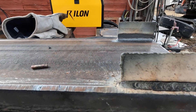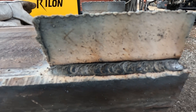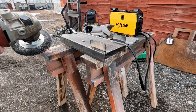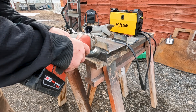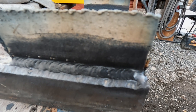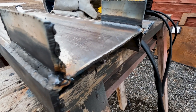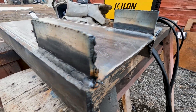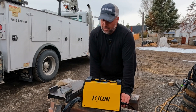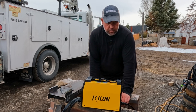Wow, that was turned all the way up — maximum amperage. You can see we actually got a pretty good weld in there. The fan kicked on about halfway through but it had no problem completing that four-inch weld. So that burned in pretty good — I think it looks better in person than it does on camera. It definitely got full penetration. That's just slag. As you can see, that's eighth-inch steel here on a little I-beam — that's where I cut the coupons out. I had it turned all the way up welding hot and it did pretty good. I'm surprised it didn't cut off on itself, being only a 30% duty cycle.